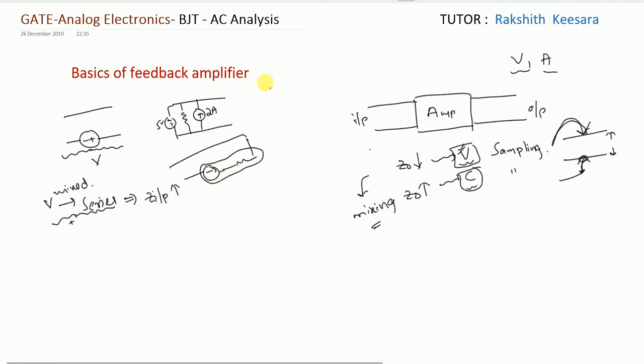What we need is, if there is 2 ampere current flow, we need to add to that 2 ampere some 0.5 or 0.6, so that it will become 2.5 ampere. If you apply in series, suppose there is 2 ampere flowing in this circuit. If you apply in series 4 ampere, this 4 ampere will not add to that 2 ampere. Instead, the whole circuit will carry the current 4 ampere. So current source should be applied in parallel so that it can add the currents now.